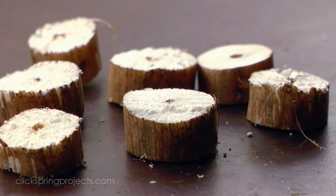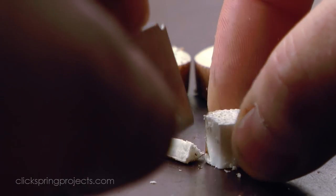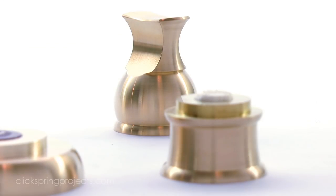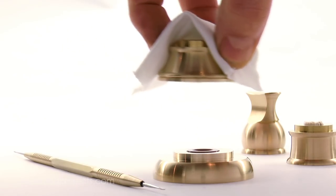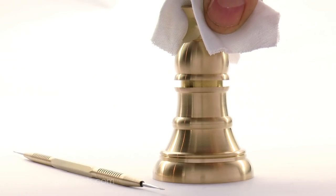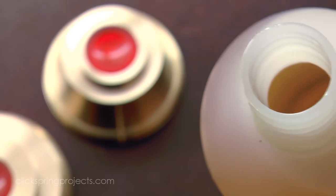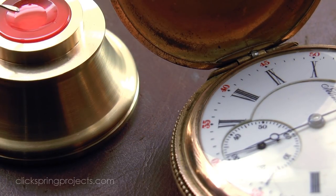The oil absorption properties of pith wood make it most suitable for cleaning dirt and oil from the nibs and for preventing cross-contamination between the different oil grades. In use, a drop or two of oil is transferred from the main oil supply. The smallest quantity can then be picked up and precisely applied to the mechanism.